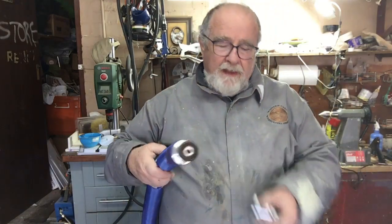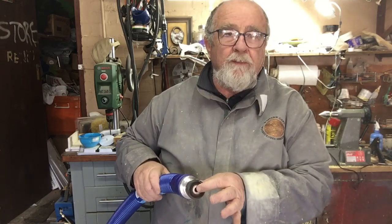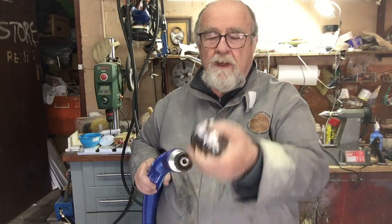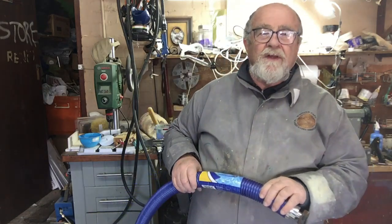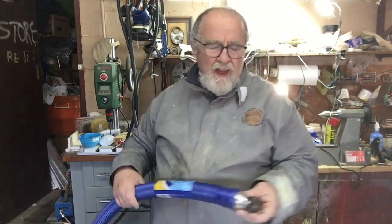Actually, you see, what I've done is the same thing. I've got a bearing, I've got a bush with a hole that sits on a pipe, and this one sits exactly inside here. And that's my vacuum chuck that I created, on the same system as the handwheel.